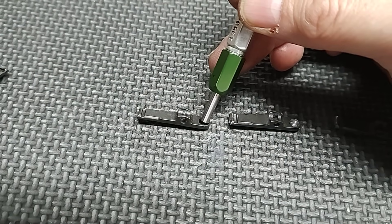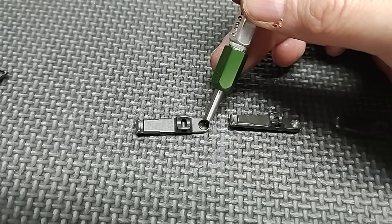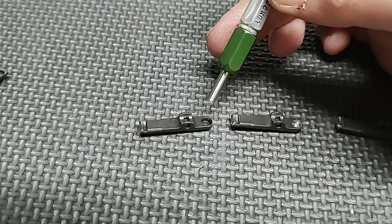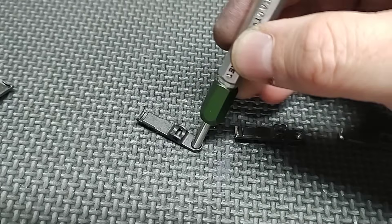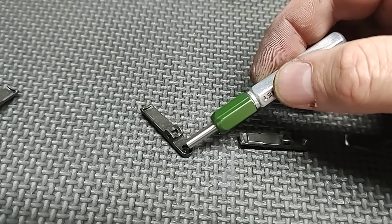It's a pretty common problem. Just about all manufacturers that put less-than-good springs will often have this pocket here — it's undersized. I have this gauge here, and this gauge is supposed to go into the pocket and basically click in. That indicates that the pocket is sufficient to take a good spring.